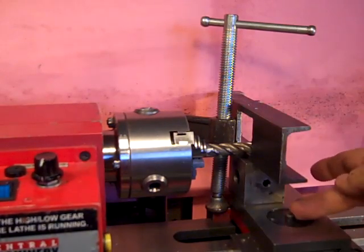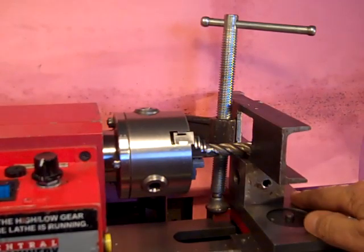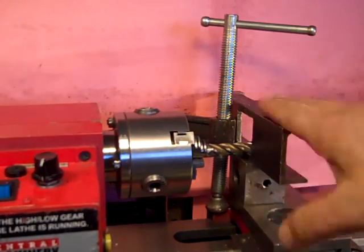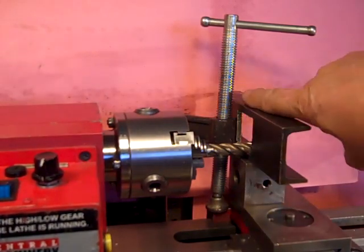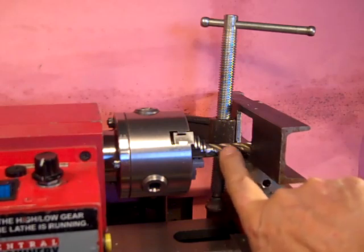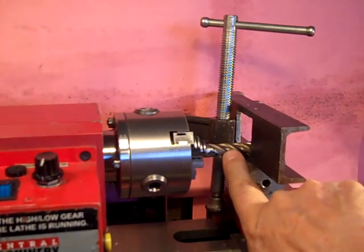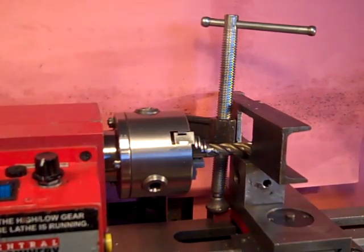Now, I took the cross slide off, so now I have to move the whole carriage in and out, because I made this plinth type thing to hold the work. What you see here is milling with a 1/2 inch end mill. I believe this end mill is for aluminum. It was like $2 from China. You're not supposed to chuck them, but I haven't chucked. There's so many things wrong with this setup, but anyway, that's what you do when you don't have money or tools.